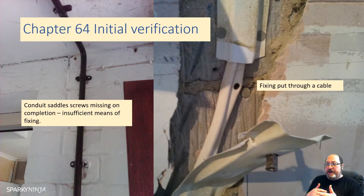From a persons and livestock perspective, there's a risk of electric shock. If we're going to be driving voltages through exposed conductive parts and metalwork - such as during insulation resistance testing - persons can receive a shock from that. Livestock, especially with electrode testing, could even be killed, so you've got to make sure you consider those risks. With regards to the building, we need to minimize dismantling, so it might be the case that the initial verification is carried out during part of the erection to then later not need to dismantle it further to re-inspect.